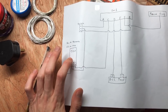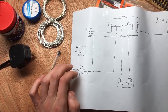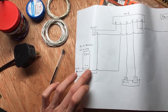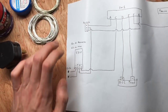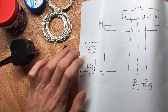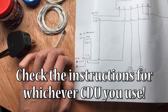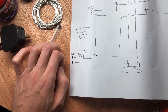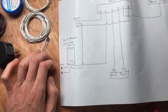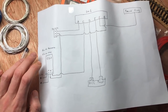As I said, this capacitor discharge unit is optional. If you're not going to use one, you've got your main power input — 12V DC — and you would just bypass it and carry on straight through. If you're not using the CDU, your positive and negative starts there. If you are going to use the CDU, in particular the Gaugemaster ones which most people use, the recommended input is 16V AC, with a maximum of 25V AC. However, you can use a varied amount of voltages and currents as it is quite simple electronics. A lot of people use 12V DC and have reported no problems, so that's what I'm going to use, because I've got a 12V DC output on the back of an old controller.